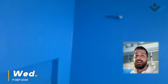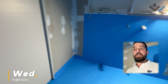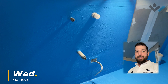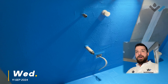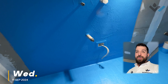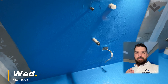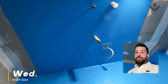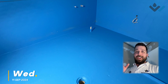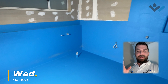That's it for the walls - we've gone through all of those previously and I'm pretty happy with all of that. Electrical work is still to be done and we'll see that in the future. One thing as a precursor: we've got a nice waterproofing membrane here and we are going to be hanging a vanity on this wall. What we don't want to do is punch a heap of fixings straight through that membrane, so we've got a strategy on how we're going to do that and I'll show you next time. Final overview, make sure we capture a good record of everything in this bathroom - and that's it for today.